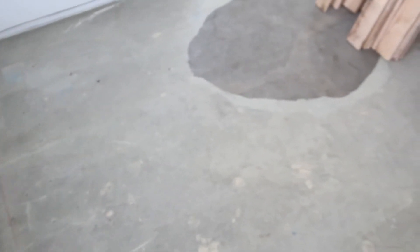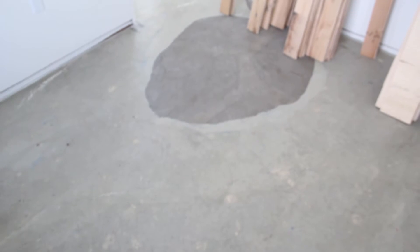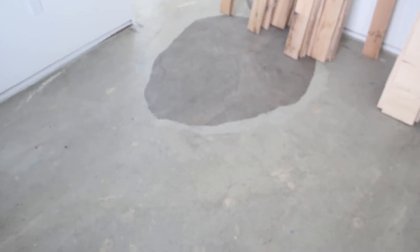It's great to glue down on these floors. A little bit about slab prep: we rolled on a vapor barrier that goes on underneath the mastic — it's rolled over the whole floor. We used the Bona system. You can do an all-in-one vapor barrier and mastic that doesn't require the previous vapor barrier rolled on, but in our case it was a little cheaper and easier to roll on the vapor barrier ahead of time, so when we were gluing down with the mastic we didn't have to be as concerned about full coverage and spread.